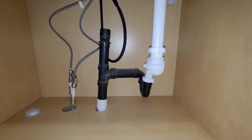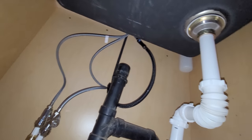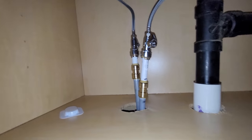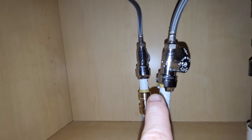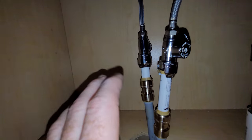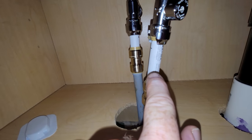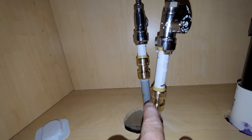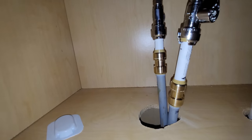It appears as though we've done it! We got the flexi tube on there to take away some of the stress - she's still a little bit stressed but not as tight. It doesn't appear to be leaking. I had to go back and get SharkBite couplings. You have to get a coupling to go from polybutylene to PEX or CPVC or copper - the little yellow inside the SharkBite works for everything except polybutylene, which needs a little gray connector. Everything's on, water's running, I see no leaks.